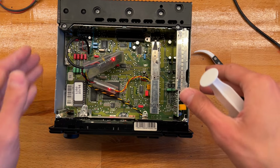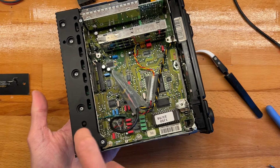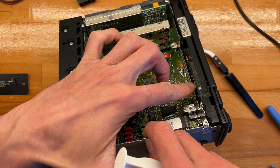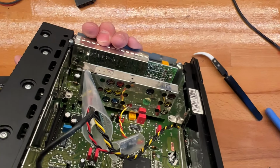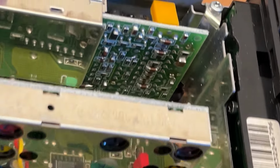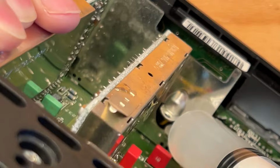And to that extent, I wanted to do this on video, I almost forgot. So I think I'll show you guys this and we will be done. If you want to see the other radios, I do have a playlist. So you have this wire loom with 4 wires, right? And it's going right next to some stamped metal, which is sharp as fuck. I'll tell you. What you want to do is get some sanitary silicone in there just to not have this rub right against that. So this is extremely complicated to film and inject, but I think we got it.